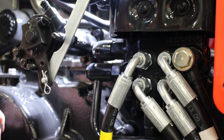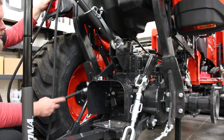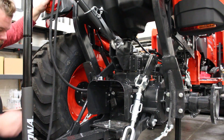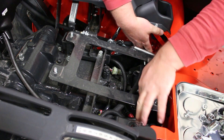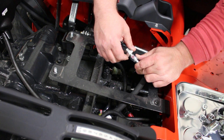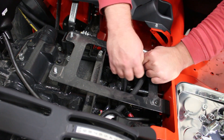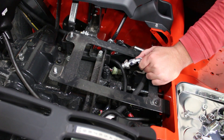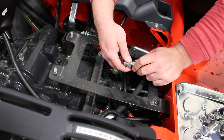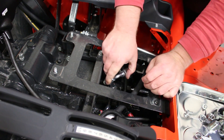After we do that, we'll go ahead and do the wiring and get into the next section. At this point we're going to start routing the hoses to connect the return port. Because I've got it mounted on the left side of the ROPS here, we're going to go through this left side and then loop around back to the right side of the tractor — this will be the return that goes back to tank. A good way to do this is to keep your hose fittings where the adapter screws in loose to give you the swivel action when you're installing this, so you can turn these hoses in the correct orientation to get your 90 degree to connect to this port. You can also leave the opposite side — the JIC that is connected to the valve manifold block itself — leave that loose as well. Thread them in maybe halfway but let them swivel, and that'll give you a lot of play to get the orientation you need, making installation a whole lot easier.